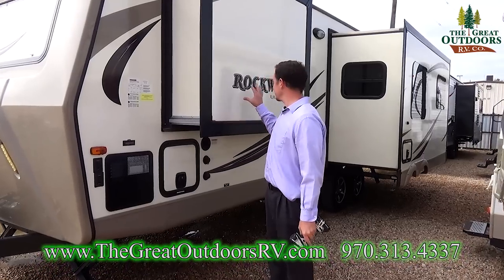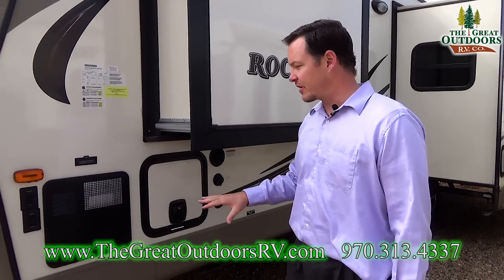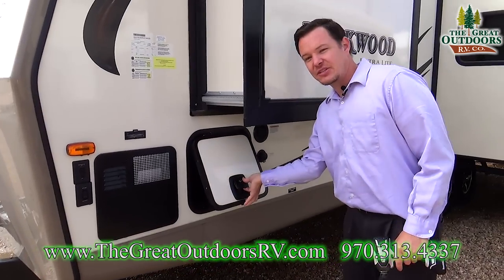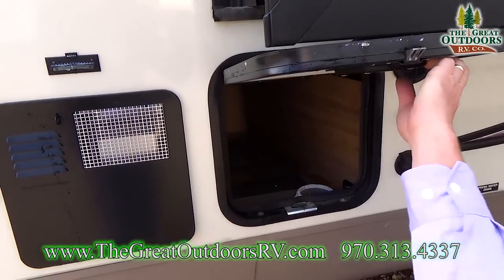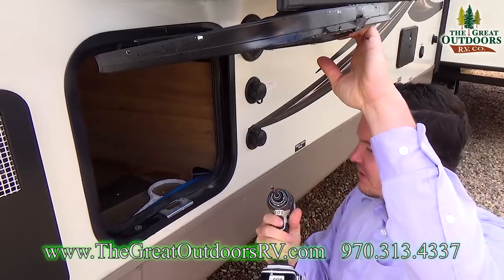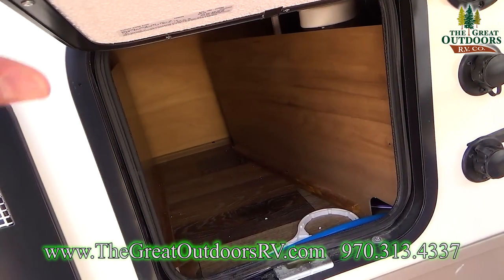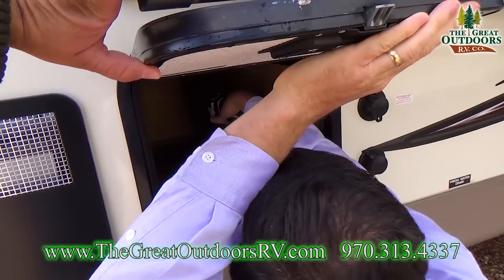This is a Rockwood camper. You need to find your water pump and water heater. This is what your water heater looks like and usually your water pump is going to be pretty close. In this case we're going to access it from this storage door. There's usually something blocking you — if there is you'll need a little square head bit. Phillips will work as well, but ideally you'll have a square head and you need to remove these panels to be able to access everything behind the water pump and by the water filter.